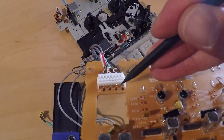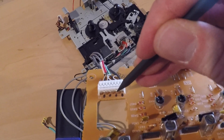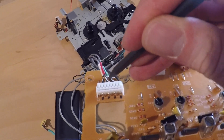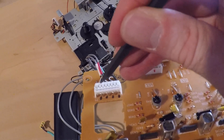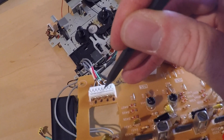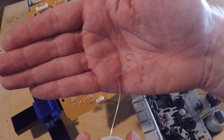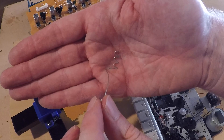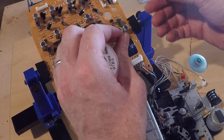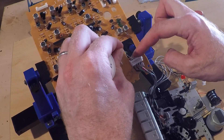I got all the ground pins cut. I first marked them with black, cut the pin, and bent it to the side slightly just to make sure it's not making contact. I originally did it without the connector connected — I would suggest doing it with the connector connected because it bent the pins and I had a hard time getting it reconnected. I got my little jumper strip bent out from this wire, and I'm just going to solder it in place to jump all the grounds together.